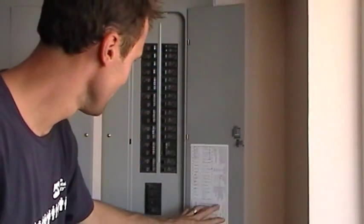Let me show you the emergency critical load panel. It's got all the appliances, circuits, outlets, and lights that this homeowner wanted on his emergency backup system — all these breakers. Now this is probably more power draw than what our batteries and generator can handle. So what we've discussed with the homeowner is that when the generator kicks on providing that last bit of power, he's got to come over and turn things off, like the air conditioner.